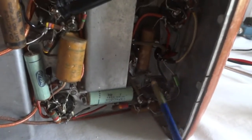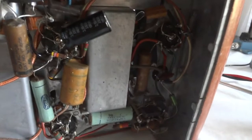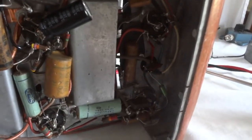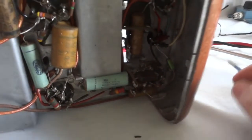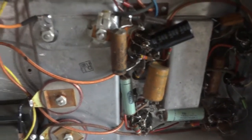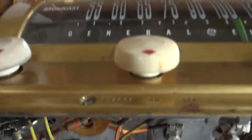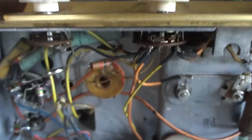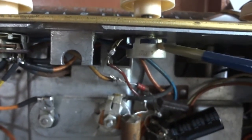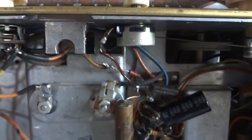This is the RF section. I had to do quite a lot of fixing there — some idiot had done modifications with no clear intent, and the result was that the radio didn't work and the RF stage was turned into wide-band with not enough gain. I had to undo all that, and now it works as it should. I also had to realign it because that same person had retuned the whole radio — but that's fixed now. This switch here — the on/off and charge switch — I had to take out, repair, and clean. It was replaced in the past by a repair guy who actually did a fairly decent job, so I decided to leave it in place.